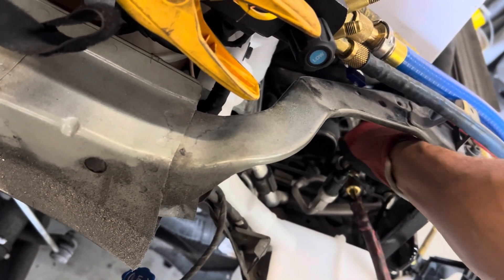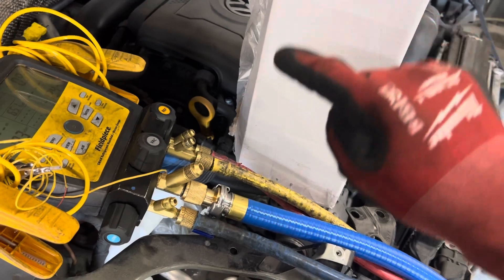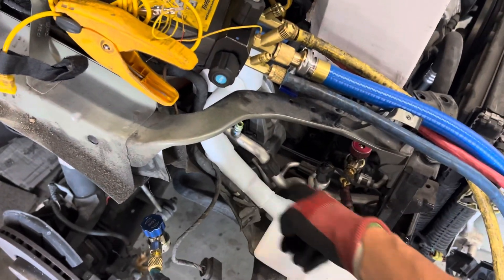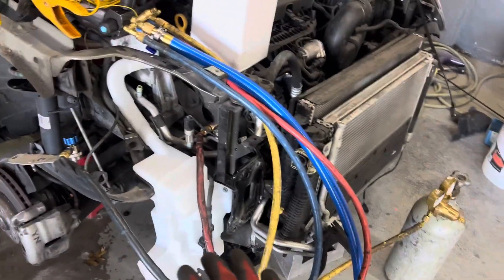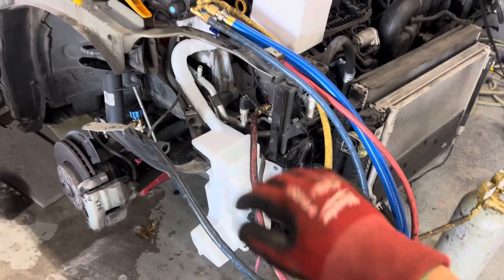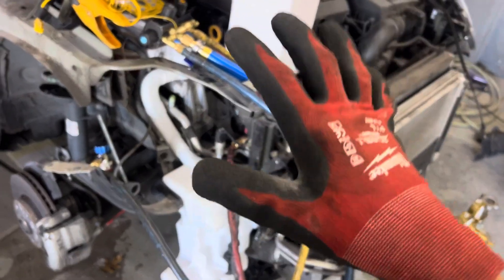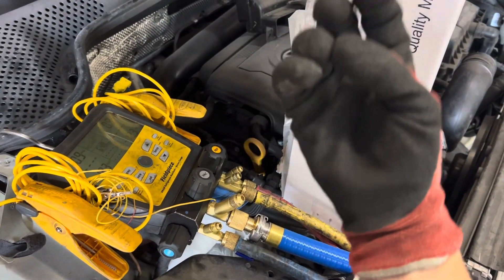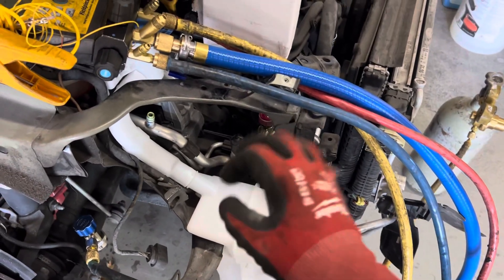In a larger mass volume than if it was four ounces of oil in a little shot glass with a narrow opening, your moisture exposure area would be the size of a quarter where the air is touching the top. But if you take that same four ounces of oil and add up all the internal surface area of all the tubing, you'd basically have one square meter of flat surface area. Spread four ounces of oil on one flat meter and expose that to the atmosphere — now you have one square meter of a thin layer of oil where all the molecules could latch on to the H₂O molecules in the air, lock on using a molecular bond, and hold on to the water. Instead of a little tiny surface area — this is why you backfill with nitrogen prior to opening the system.